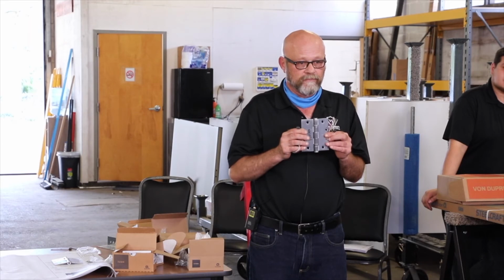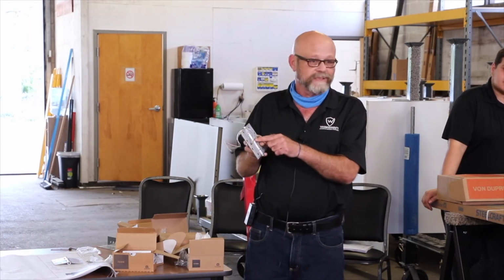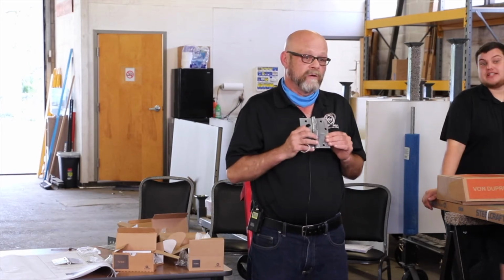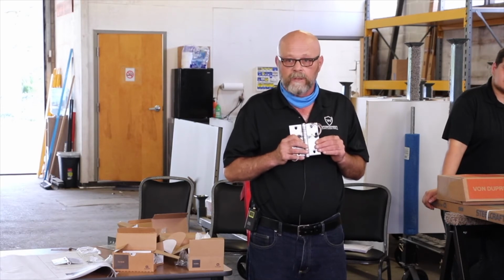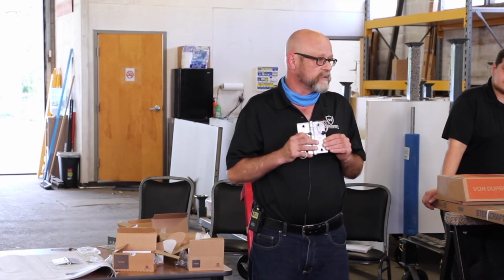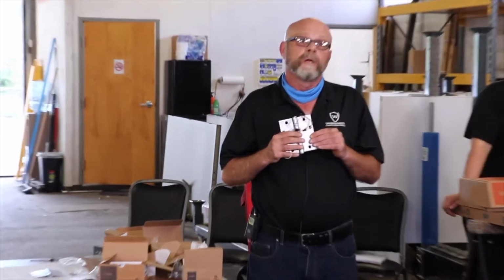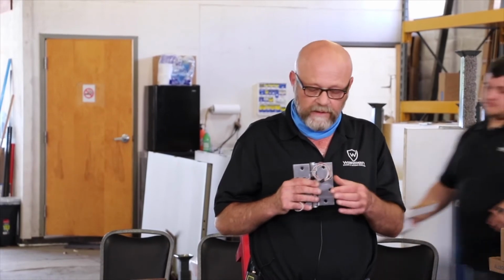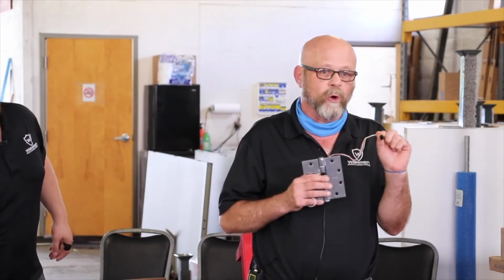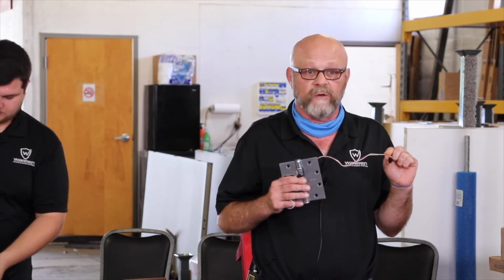I wish they used heavier gauge wire. Well, the reason they don't is because it has to go around the pin, which is why we use the other type, where you can get a heavier gauge. I myself no longer specify electric hinges. I'm not doing my customers a favor, because first of all, you've got to find somebody that stocks an electric hinge. You've got 2 wires, 4, 6, 8, 10. So we stock them with either 8 or 10, because I believe many access control companies will tie 4 wires together to make one thing work, because they're very thin.